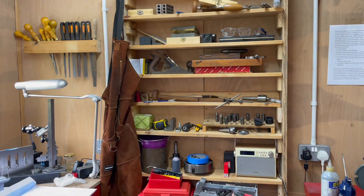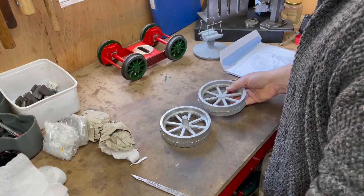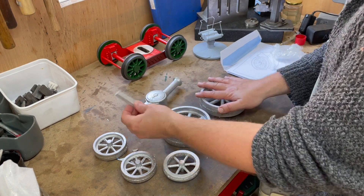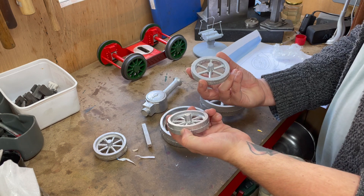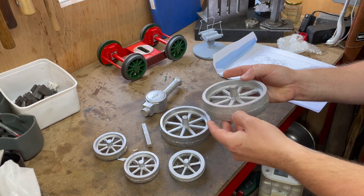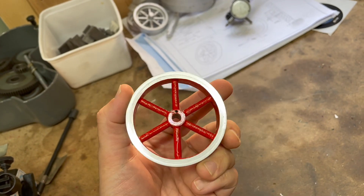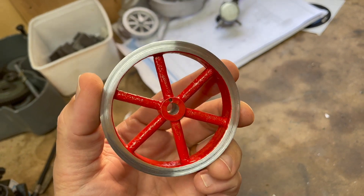So first let's see what we get in the box. Here are the two driving wheels, here's the smoke box and chimney, here's the steering assembly that goes between the two driving wheels. It looks like we've got three driving wheels but I think one of these is a casting for the flywheel — I think they're the same pattern. This material is Mazac, which is an alloy of aluminium and zinc, so it's fairly machinable. This is the flywheel for the engine that will sit on top of the traction engine; it's made of a zinc aluminium alloy and it machined pretty well.